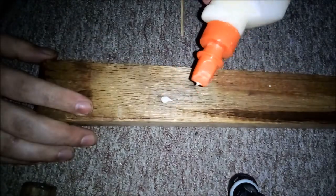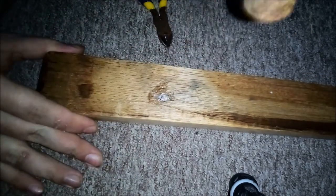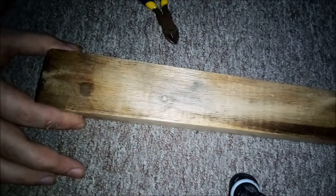It's time to fix that gnarly hand-threaded flathead screw hole. I just filled it with glue, inserted a bamboo cooking skewer, clipped it off and hammered it in. A little bit of progressive sanding and it never happened — let's call it a beauty mark, it's a knothole.